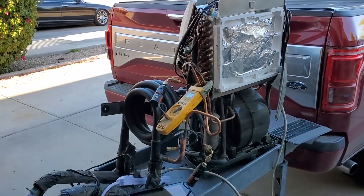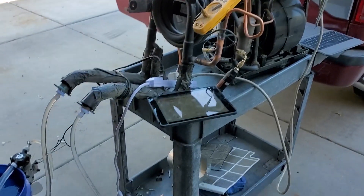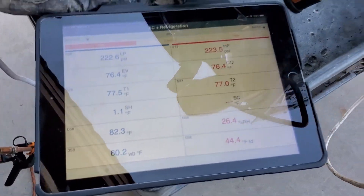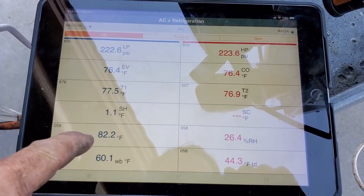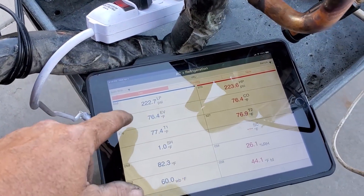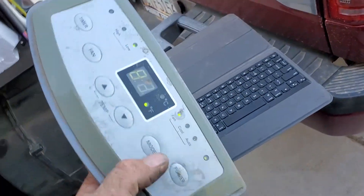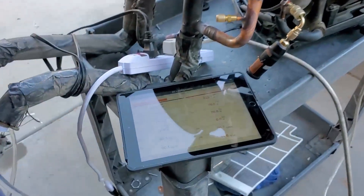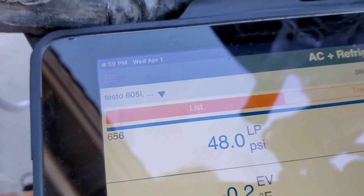What's up guys. I'm going to do another one of my tests on the small bastardized water heater, this time without the GFI circuit to trip before the test completes. I've had this running on fan only and pump only for a few minutes. My air is 82 degrees here in Glendale, Arizona. Pressures are equalized at 222, and the water is at 76 degrees. I'm going to put it to cool mode and kick it way down. I want to give it a full run and see how long it takes to heat up to 130. The time now is basically 5 p.m.